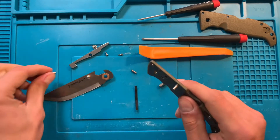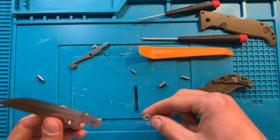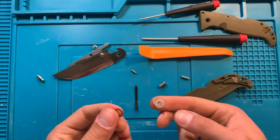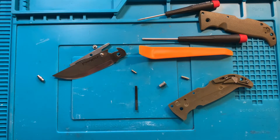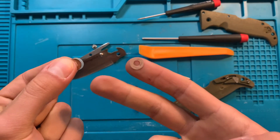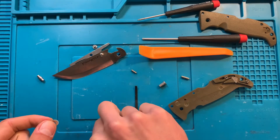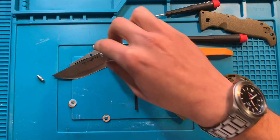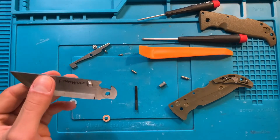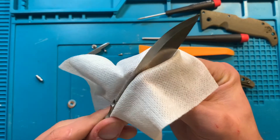All right, that's the middle, that's the blade stop, and that's the hinge pin. These are double layered. The washer — the goldish looking part there is called phosphor bronze. The whitish part is called Teflon. So if you hear bronze washers versus plastic washers, that's the conversation being had. Sometimes they get doubled up — not uncommon, just rare-ish for it to happen to only one side, which is what I thought had happened. That is your explanation.